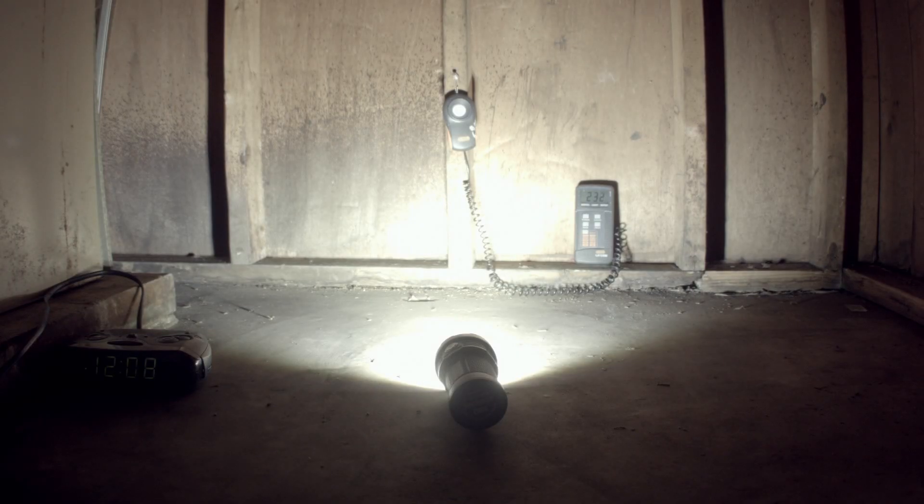Then mid: at 30 seconds in I measure 2,436 lumens. 5 minutes in we drop to 2,415 lumens — less than a 1% drop. 10 minutes in we hit 2,394 lumens. 20 minutes in we're at 2,373 lumens. Feel free to double-check my math — I suck at math more than I do at YouTube. One hour in we're at 2,342 lumens, a little less than a 4% drop overall from initial brightness. Not bad. It holds its brightness until it shuts off at about 2 hours and 49 minutes. Acebeam says 3 hours — we're just under that. Close enough.